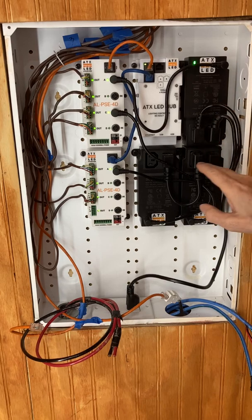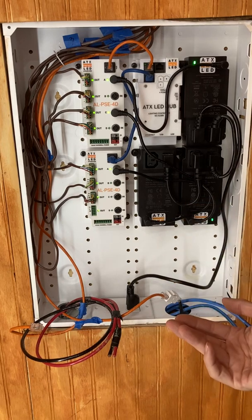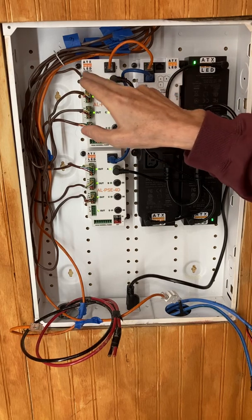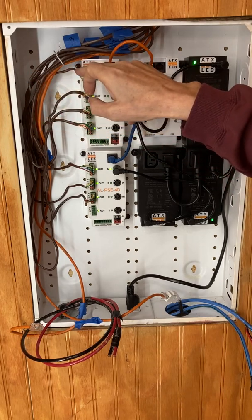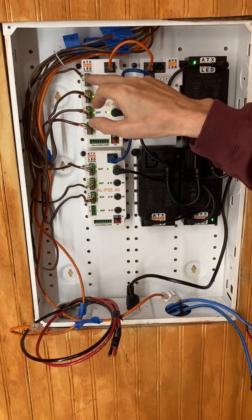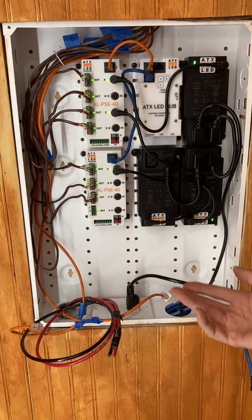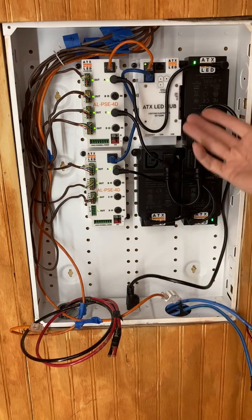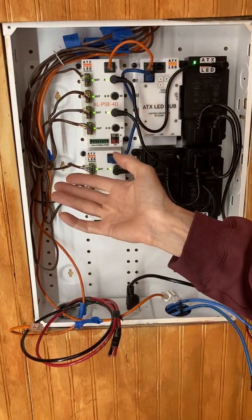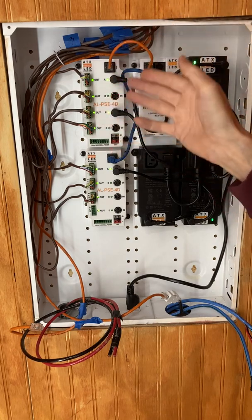Each one of these power bricks can supply 100 watts, and this is a code requirement by the NEC. We connect each one over to an input that goes to our output, and this output load can be 100 watts each. We can actually have more outputs and share that power between multiple outputs. This is also a redundancy feature — if we have one more power supply than we need, should one fail, we will automatically switch to a backup.